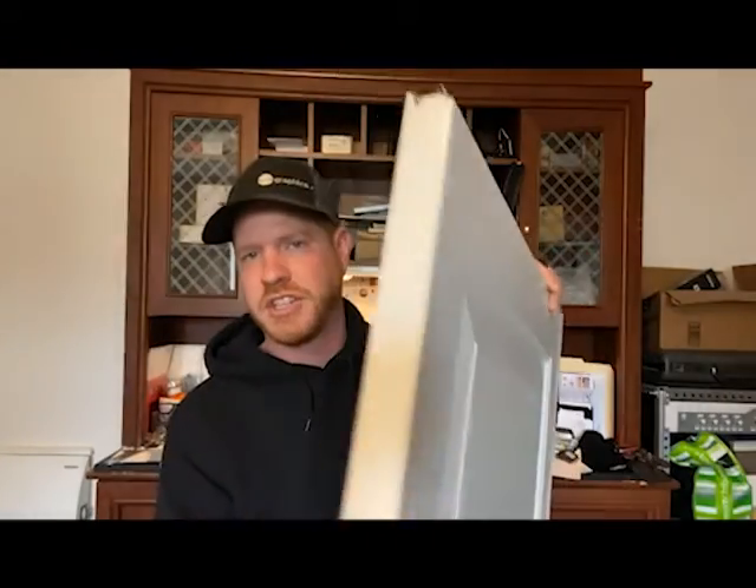The next level up, which is probably our most popular door, would be something like this — an inch and three-eighths thick steel-back door, nice and sturdy. This one is also going to provide an R-Value of six and a half, but with that steel back it's much sturdier because it's built front skin, back skin, with the insulation in the middle. So it doesn't flex or twist, giving you a much stronger door. The R-Value of six and a half is sufficient if the garage isn't heated, but if you start heating the garage, you might want something better insulated.